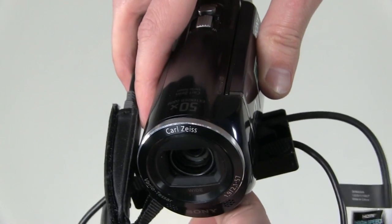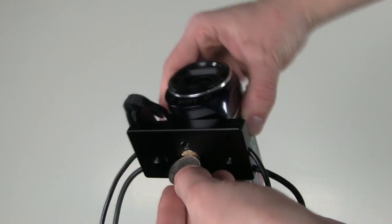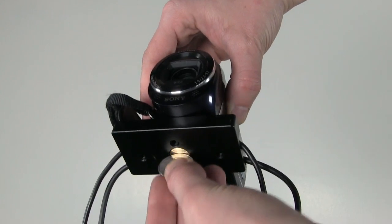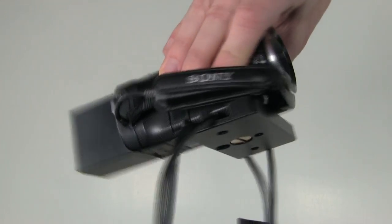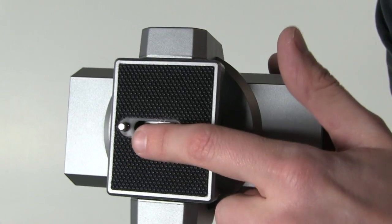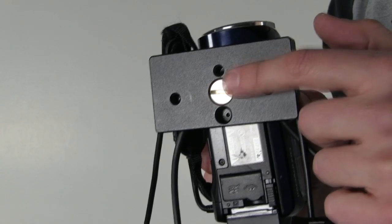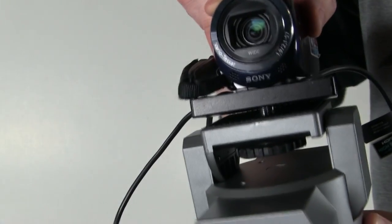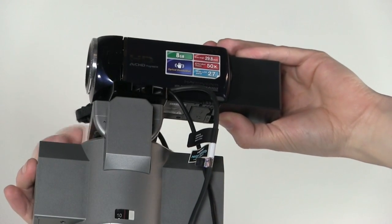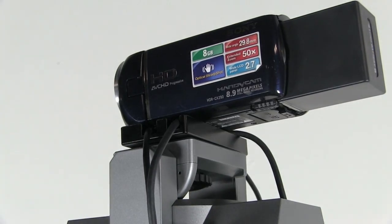When the cables are in place, attach your camera on top and then underneath screw into the camera to connect tightly using either a screwdriver or even a coin. With cables threaded under the camera using the strain relief plate, to mount to the top of the motor, find the screw inside the sliding groove — the smaller metal piece will be irrelevant. Locate the smaller hole above the golden screw and use that to attach to the screw coming out of the motor. Make sure to use this strain relief plate with your assembly — if you do not, it will affect the terms of your electronics warranty.